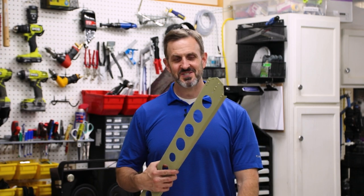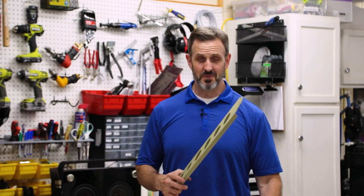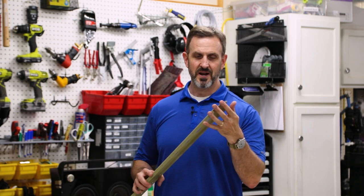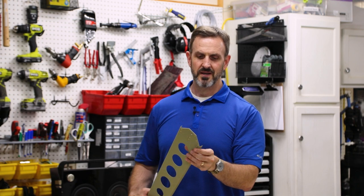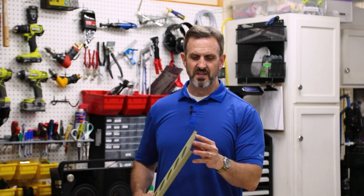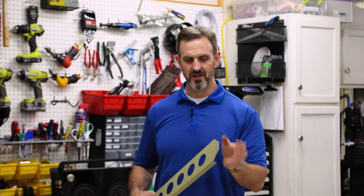Another thing is I mentioned earlier that this sort of was anticlimactic. When I put this together, it went together easy. And it did. It went together pretty easily. However, after I put it together and looked at it, I noticed that this plate wasn't fully flush with this part right here. And if I angled it right, I could see light coming through it. And so I ended up drilling out all 10 rivets and redoing it. I didn't countersink this plate deeply enough, and so the whole plate wasn't sitting flush.